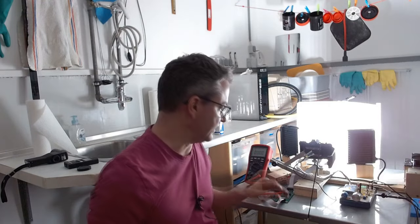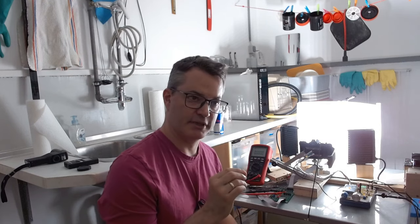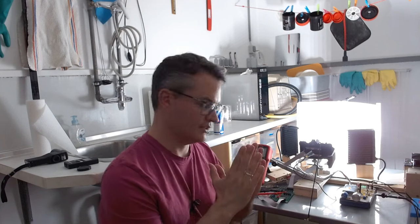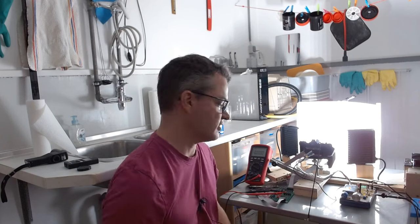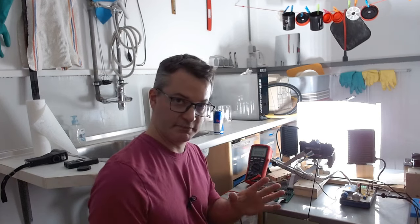The sensitive area of the photodiode is a little less than 2 millimeters, so it fits within the narrowest slit that the camera will produce in the curtains for about a thousandth of a second. In addition to the exposure time, I'm making some additional measurements.